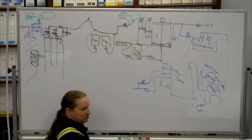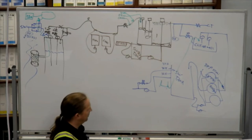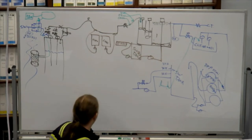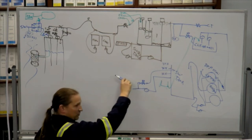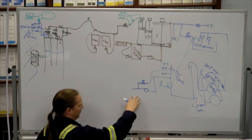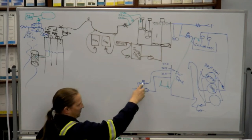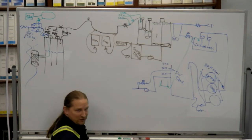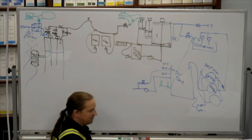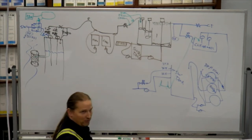On the pressure gauge? Yeah, by 135. Okay. So when we start using a bunch of service water somewhere, you open up a valve somewhere else, so this pressure goes down. And then the recirc valve pinches off to drive that pressure back up to where it was. And at a certain point, the recirc valve's shut all the way, you don't have any more control. The pump's just doing all it can.